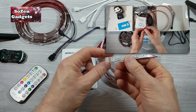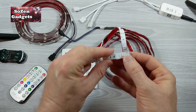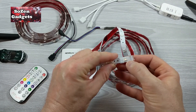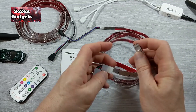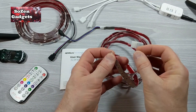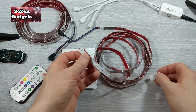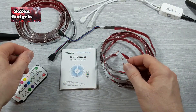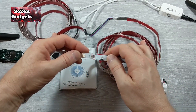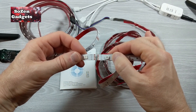You'll notice that these are all coated. This is telling you right here: 12 volt, green, red, blue. So these need to line up. It's going to matter when you connect these because they need to line up with the other strips — colors matching the same. They have to line up. This will not work — you cannot line up 12 volt with blue, so you'd have to attach these in a different sequence to get them to work.